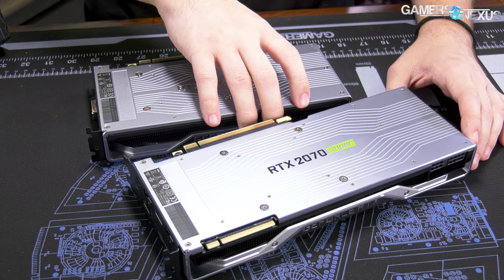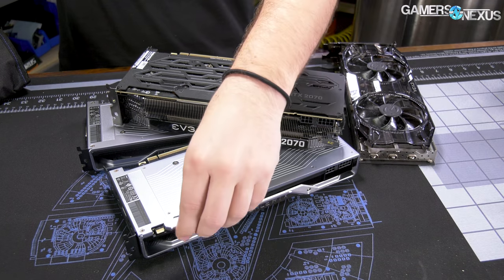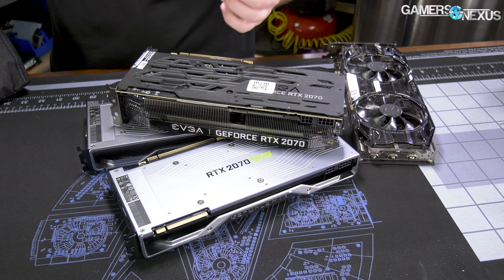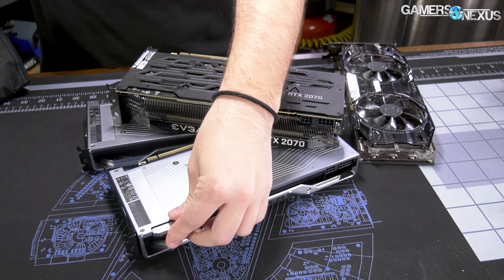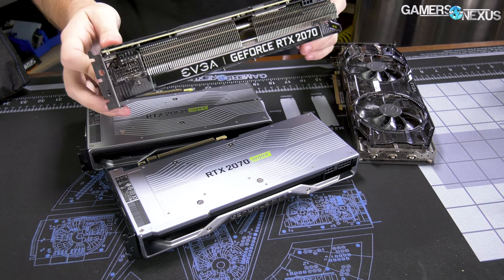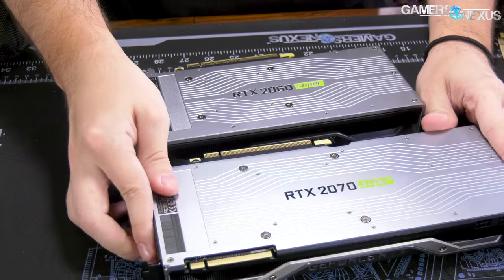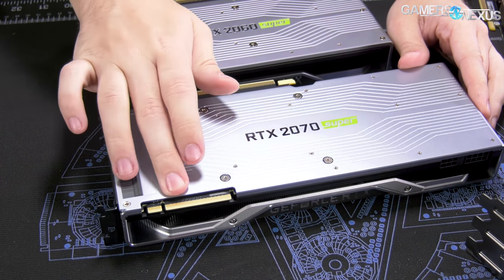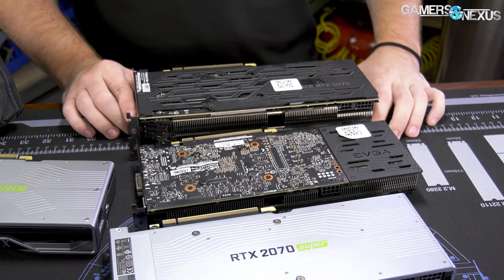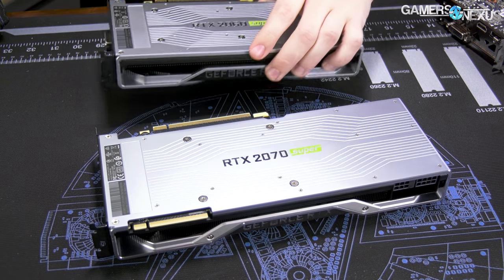We can go ahead and remove this NVLink. Wait — was there NVLink on the 2070? I need to call NVIDIA. I just now noticed, despite finishing the reviews, that the 2070 Super has NVLink fingers on it. After calling NVIDIA: yes, it does support NVLink and works exactly the same as any other NVLink setup. So update — the 2070 Super supports NVLink. The original 2070s clearly do not have NVLink or SLI support. This is because it uses a 2080 die — TU-104 — whereas originally the 2070 was TU-106.